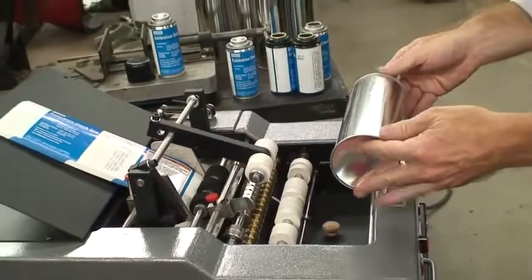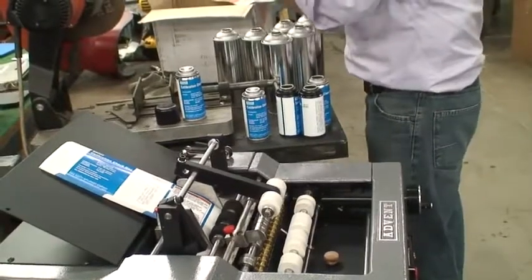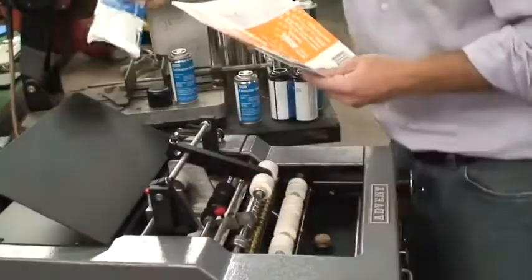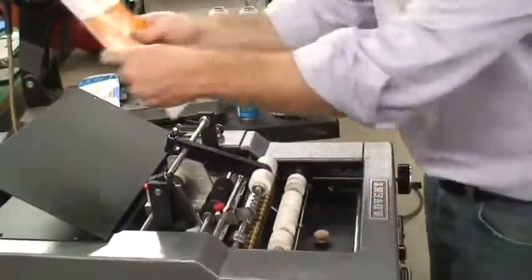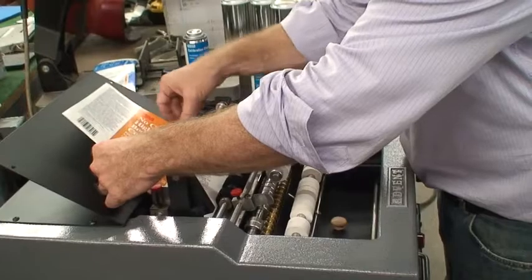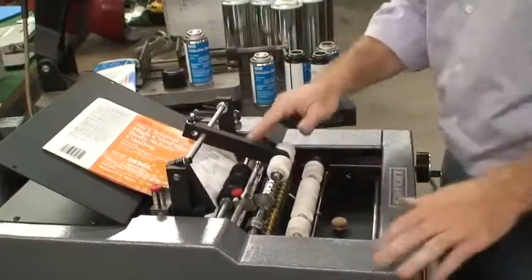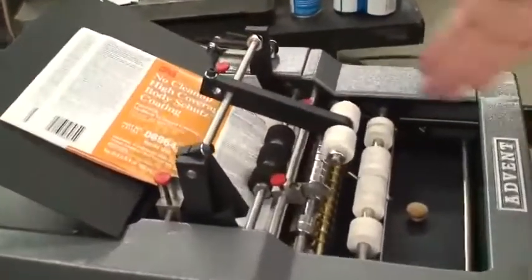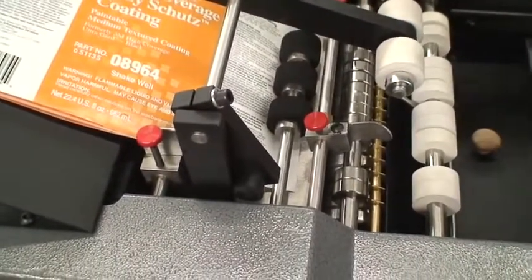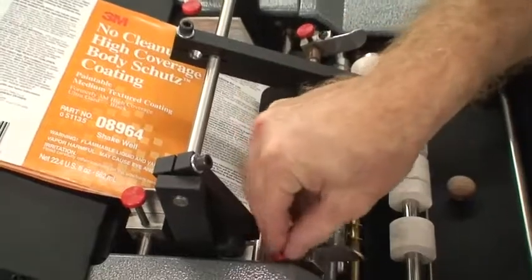Next we have these much larger containers with a wider label and larger diameter. The first thing I like to do is grab my labels and pull them out — see how easy that is. Then I open up my label guides. Usually you want to run the label pretty much on the center line of the machine, which is this middle label feed tire. It doesn't have to be perfect; that's just a good indication. Then open up my product guides.